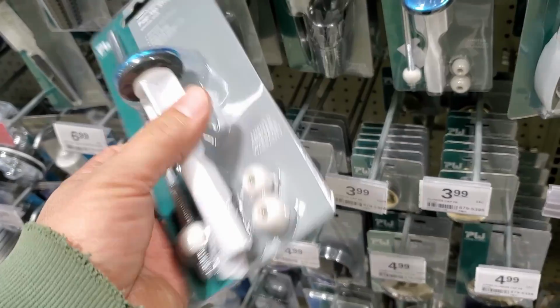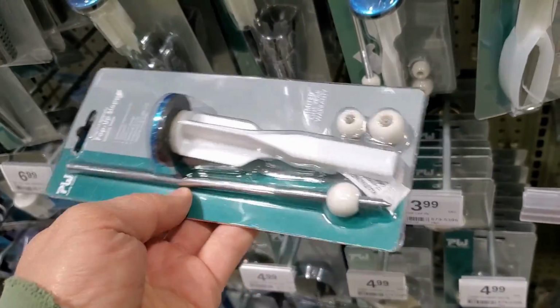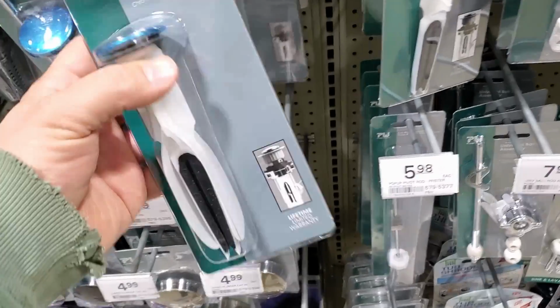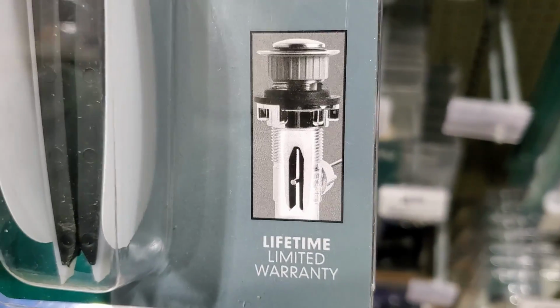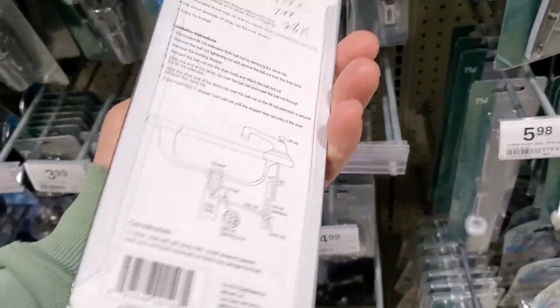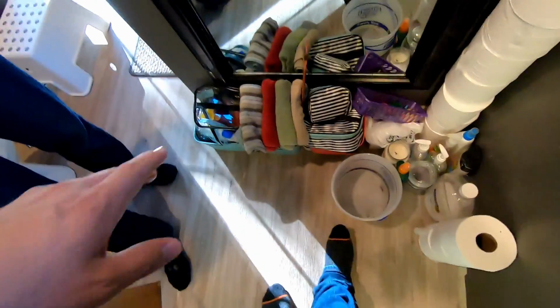I'm very excited. So they actually make a bunch of different pop-up assemblies that you can use in place of the modification that we just made. So if your pop-up is bad anyway, I'll link to those in the description. They have one that's a magnetic one that's basically going to stick to this controlling lever, or they have this style here, which kind of just pushes down over the actuating lever. But in either case, you should be able to pull these straight out of the drain without having to disassemble it down below. So this should save a lot of effort with having to pull the things out from underneath.